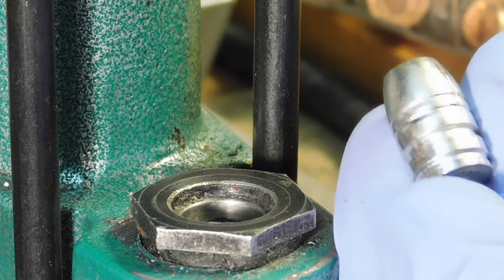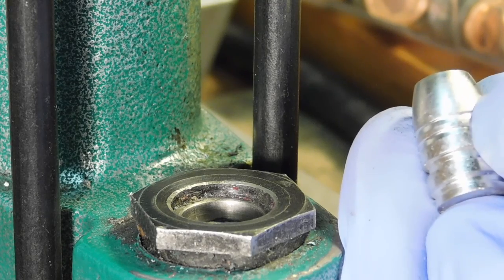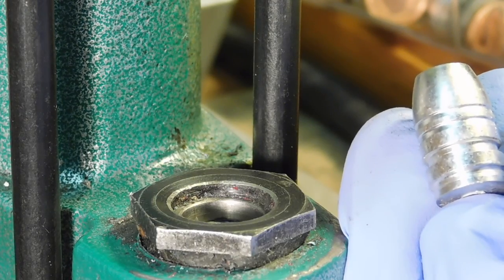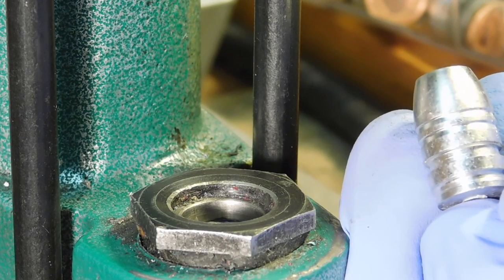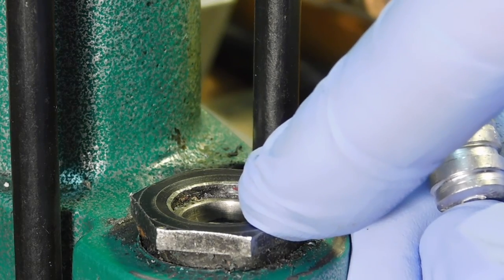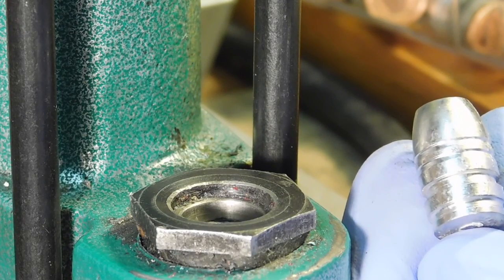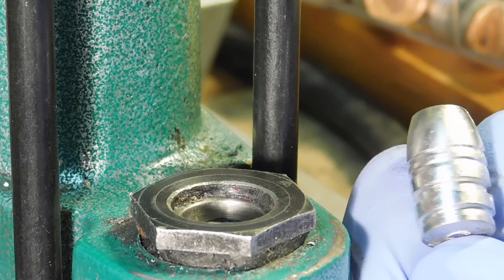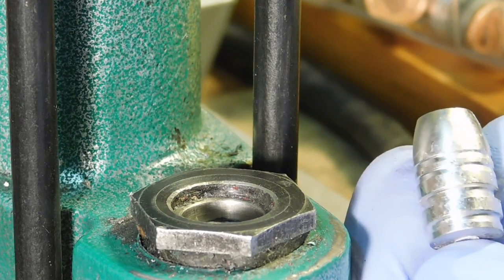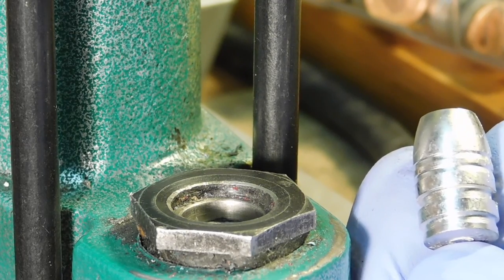Now the problem, if you want to go ahead and lubricate and size one of these bullets without installing a gas check, the problem with that is that then there's no grease groove on the base of the bullet. But the lubricating sizer press wants to put lube in there, so you'll have a kind of a messy base. So traditional lubing of these cast bullets without the gas check is not as favorable a procedure.